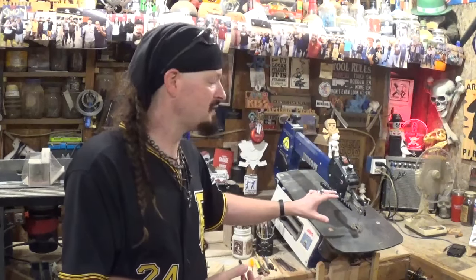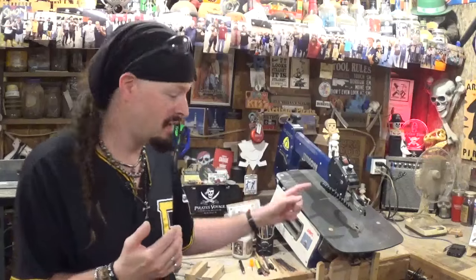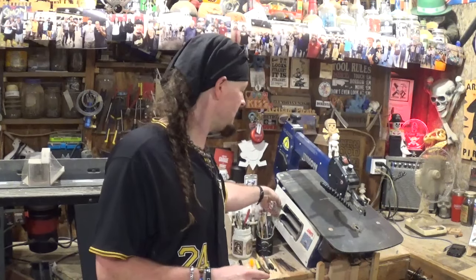I've done live demos on the Rikon scroll saw as well as the older Delta scroll saw I had out here in the workshop for years and years. It's still out here. It's under this one on the shelf down there. But again, I hope this video inspires you guys to at least try compound cutting. Of course, making sure your scroll saw is dialed in at a perfect 90 degrees is essential to make sure all of the compound cuts that I showed you in today's video come out cleanly and precisely.